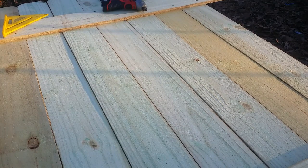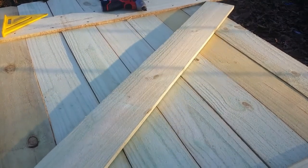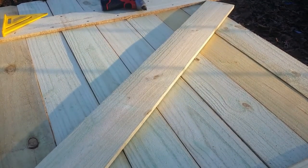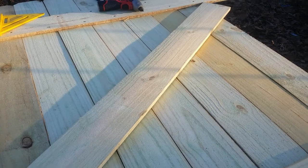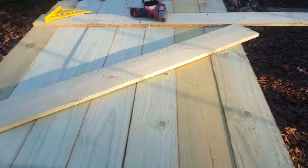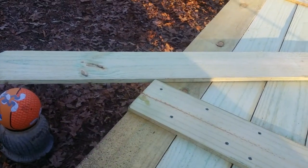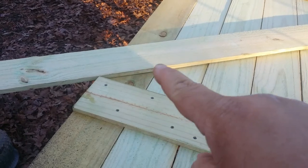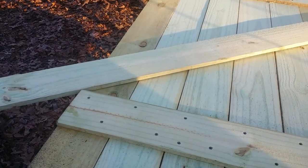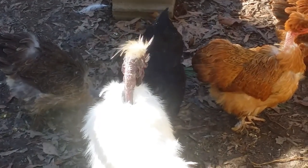And here's the 10th board. We'll just put it down horizontally just to make that classic Z pattern on the barn door. And just line the tip up there at the top and then let it hang off on the bottom. And it's gonna get cut off too with the circular saw. And again, I'm going to put 2 screws for each one. It's just quick and simple, easy as that.